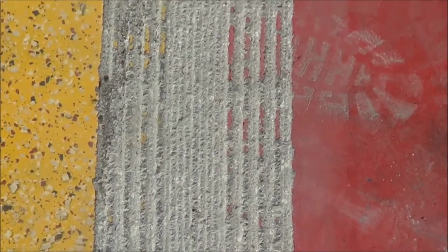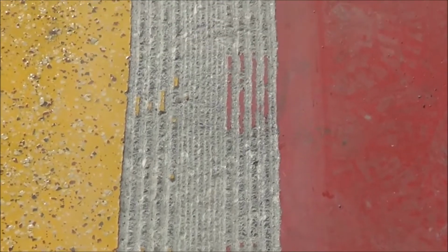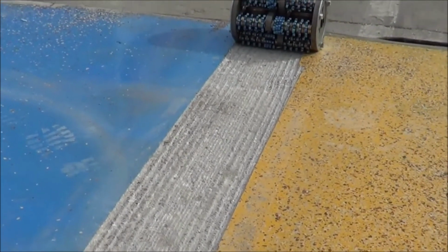Remember, this scarifier is designed to remove 1/8 of an inch of concrete per pass. If the application calls for deeper removal, scarify the area multiple times. Removing too much per pass will damage the drum and accessories and will slow the task significantly.